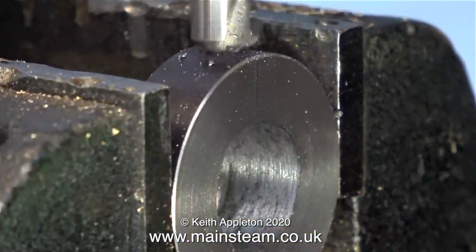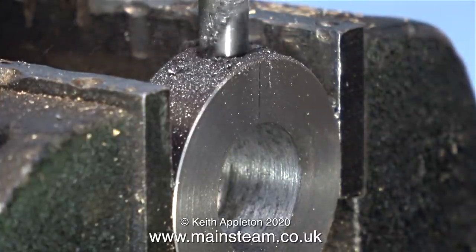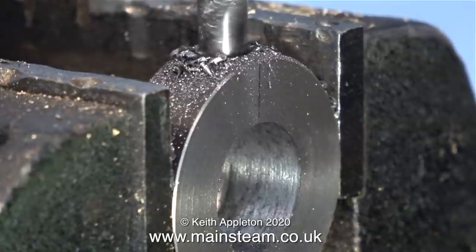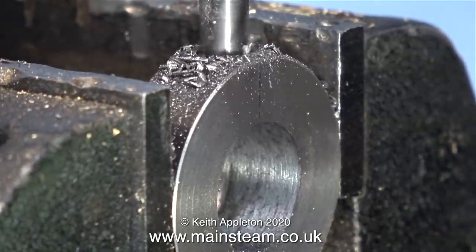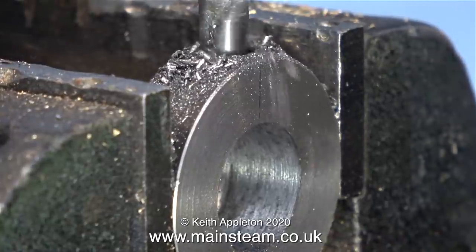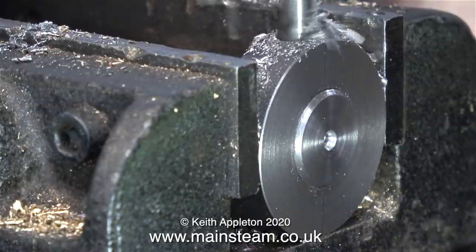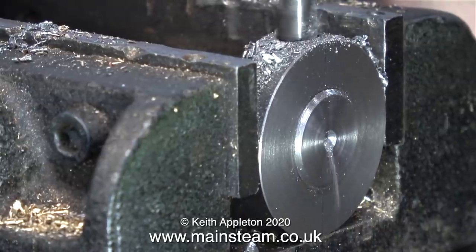Over now to the drilling machine to drill a hole all the way through the center. For this job to be really accurate, what I should have done is used my rotary table set horizontally and then by using wigglers and wobblers to find the center position accurately so that the hole in the collar was 100% accurate. I used an alternative method — perfect for someone like me who still thinks that pie is edible and isn't exactly 22 over 7. I just stood back and sighted up the drill with the line, shutting each of my eyes in turn, then opening them both to check it was exactly in the center. I center drilled the part first, followed by going through with a 9/32-inch twist drill. It's very important not to go all the way through and start drilling the bottom bit because it will be out of line.